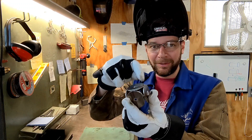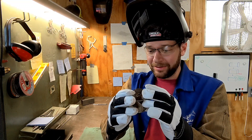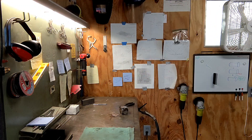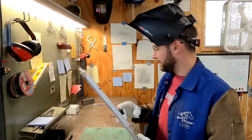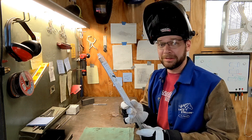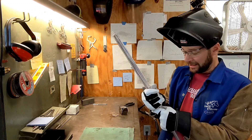I think what I'm going to do next is just reinforce all the little tack welds I did with some actual filler rod, because those are tiny, tiny tacks. And if you're wondering, I'm going to use 308, because this is 308 stainless, and this is Blue Demon. Is that good? I don't know — probably fine. It's what I got.